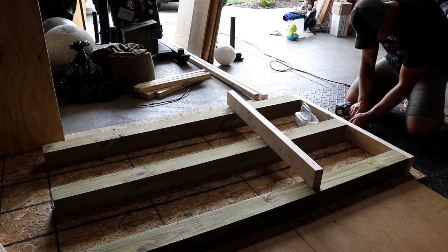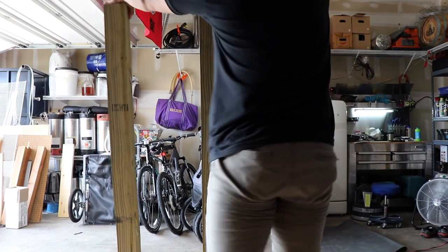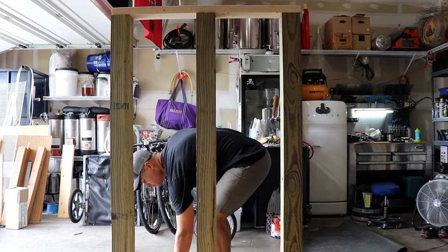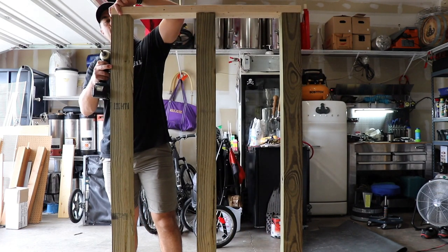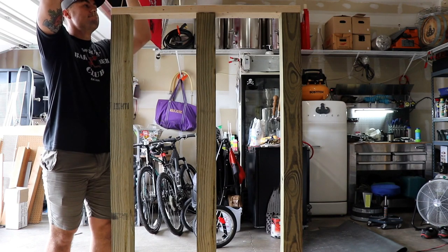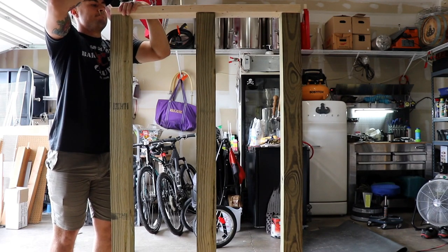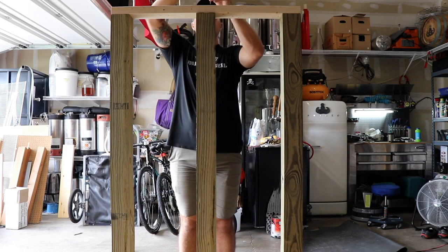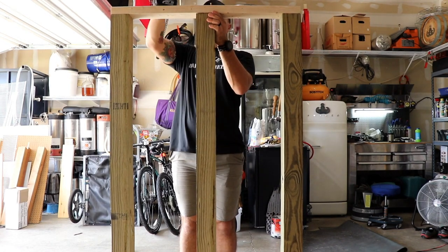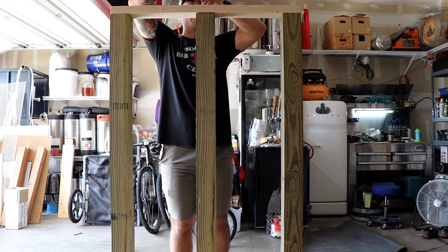There are some joints that are glued later. To make sure it was standing flat, I stood it up to put the other board on top. This is where the mark comes in handy — I lined up the middle of the 4x4 with the mark I made in the middle of the board, allowing me to center it and make sure it's nice and flush. Once this is together it's very secure and strong. The six total 4x4 by 5-foot boards were more than enough.